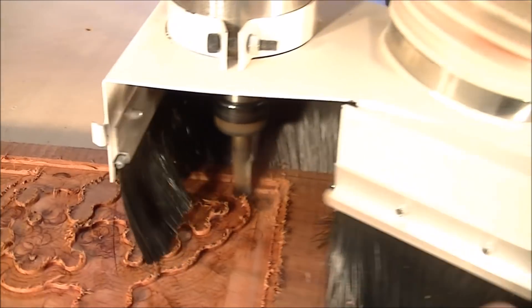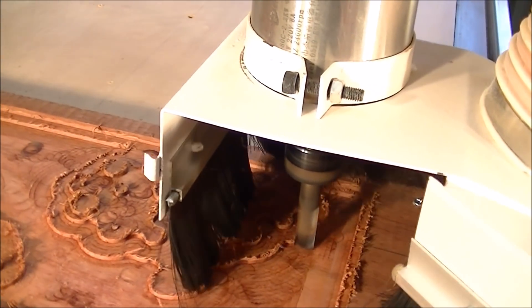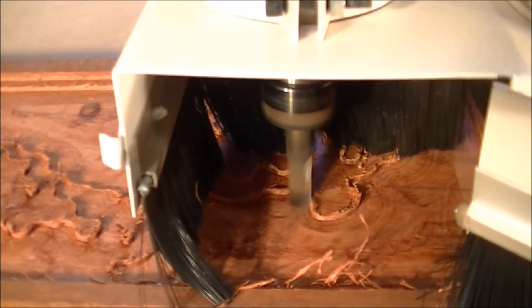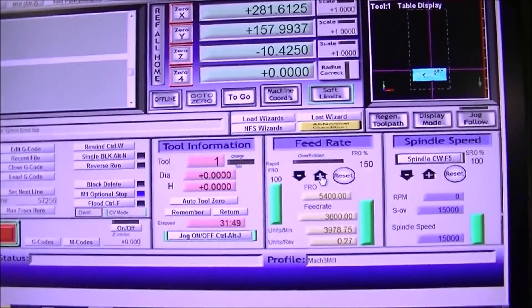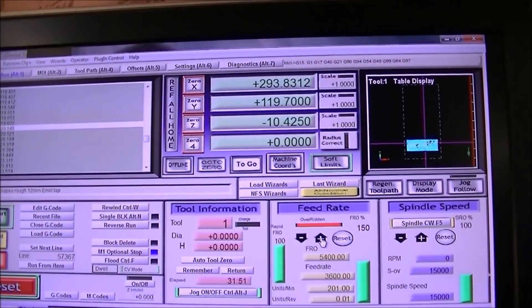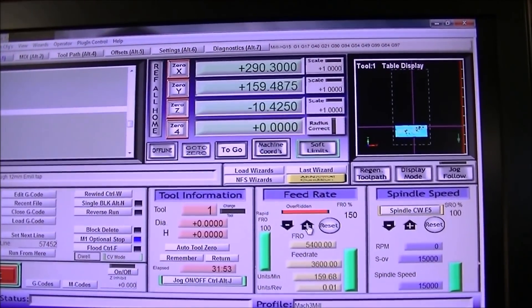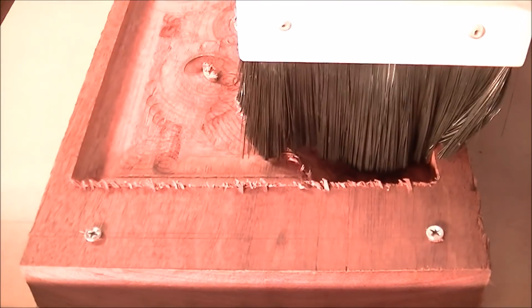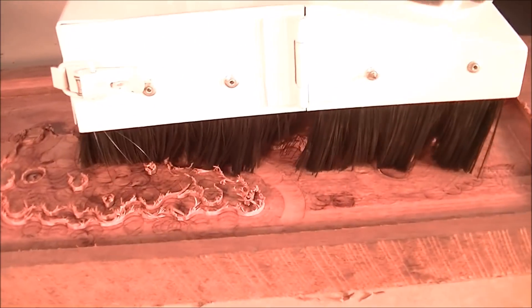In this next clip I'll show you a little bit of Mach 3, and what's more important is the tooling marks left behind are quite plain in this shot — you can see they're quite grouped together, showing that it is a 3 millimetre step over and step down. But I've actually speeded the feed rate up. If you machine too quickly it can splinter, and it can actually burn if you have the router tool spinning too fast. This is 18,000 RPM, which is quite fast enough. It's a 3-flute end mill.